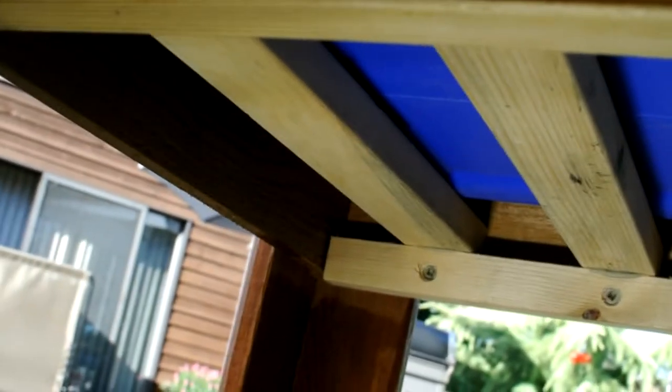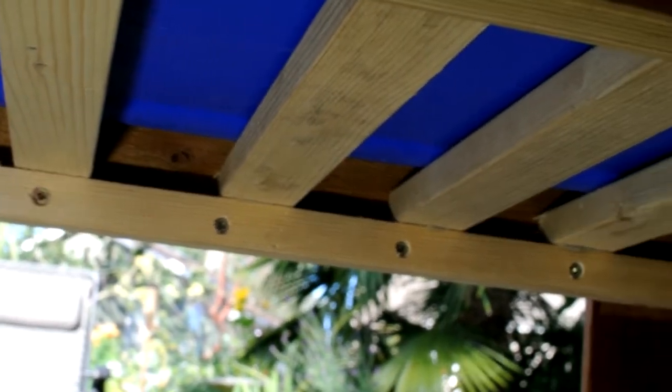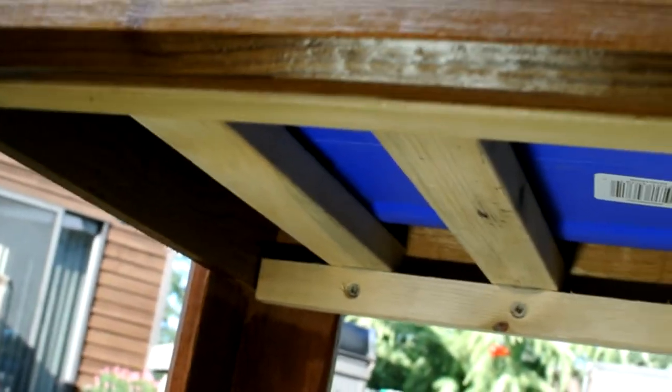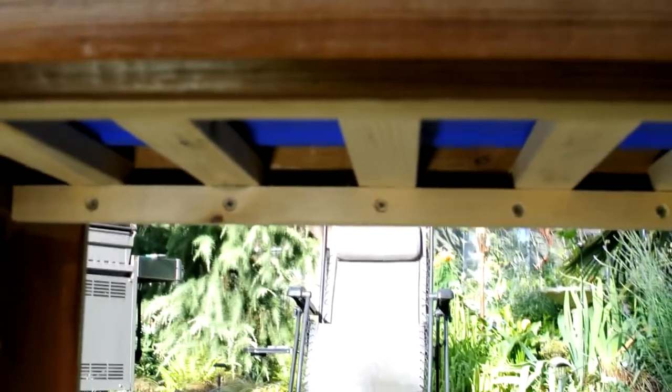At the same time we can make the shelf for the cooler to sit on. Knowing we're putting a three-quarter inch trim piece on top, I ripped down a 1x2 to three-quarters of an inch, then pocket screwed the 1x2s together making a shelf. Another way to do this is leaving the panels longer to accommodate for the 1x2 — I thought of this halfway through the build. A lot of builders just nail boards to the bottom and you can see the end grain, which honestly doesn't look too good. I wanted a hidden shelf inside instead. At the end of the day you just want that cooler to be flush with the top of your cedar box.